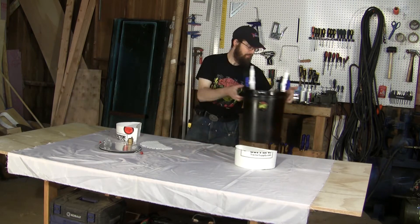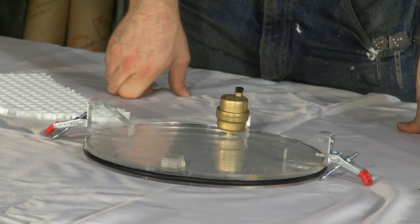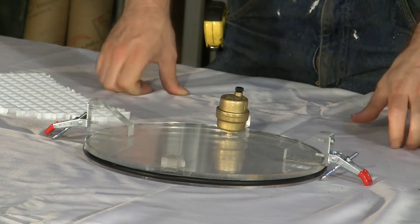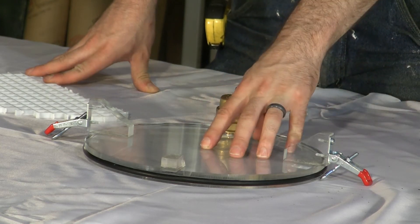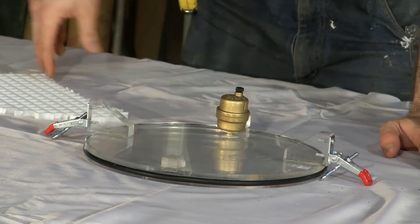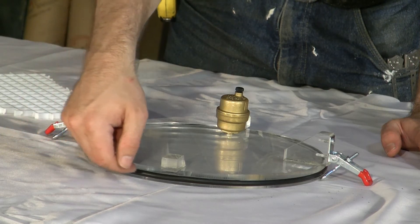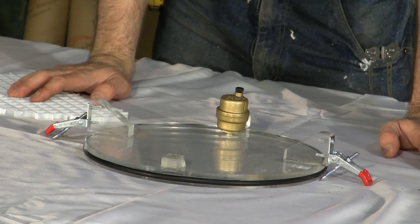The lid started with a single square 12 inch by 12 inch piece of acrylic — a 3/4 inch thick scrap. I cut a wood template and shaped it into a circle, then used the template as a router guide to carve the acrylic into a thick circle. Then, using a slot cutter bit, I worked my way around the circle cutting a slot to fit the quarter inch O-ring.